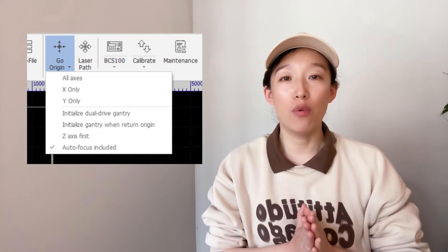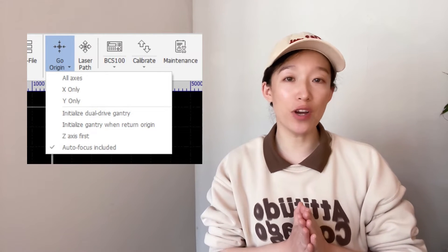For solving this problem, we need to inspect from 3 points. First, it's possible that the focus axis is not back to origin for a long time, which causes the real zero focus to change, and so affects the parameters we use. Enable the focus back to origin and see whether the initial cutting parameters are valid.